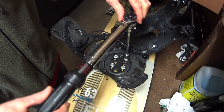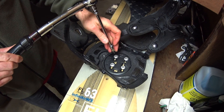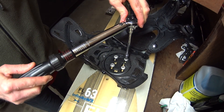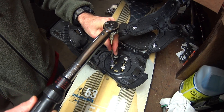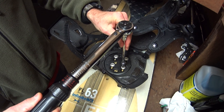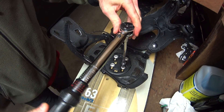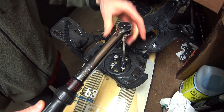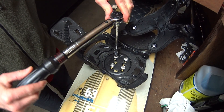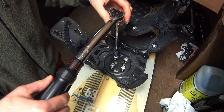When you put it on your board, I've got an adapter here to put the Phillips head in. Just go in the criss-cross pattern and make sure your click wrench just clicks lightly on each one. There you go — back and forth.